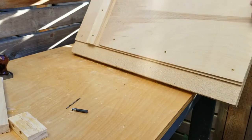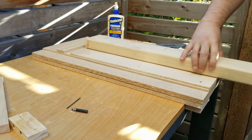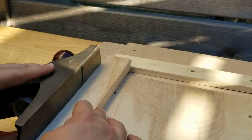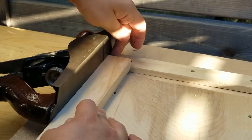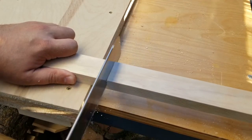So now the board is ready for general surface planing. You can see that a normal board will get caught here at the top. But if I were to try shooting off the side of the board with this small stop, it's likely I'll get some tear out at the top since the material isn't right behind the cut there. So I need to build a larger stop for these bigger pieces.